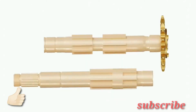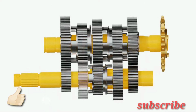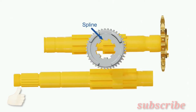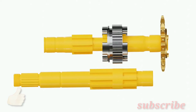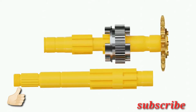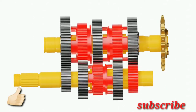First, let's understand the arrangement of different gears in the gearbox. There's an input shaft and an output shaft. The gears are arranged with their axes aligned to their respective shafts. Some gears are internally splined. These splines perfectly mesh with external splines of their respective shafts. These splines allow gears to slide from side to side while maintaining the same angular speed as the shaft. All gears which are shown here in red color are splined.